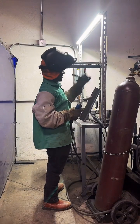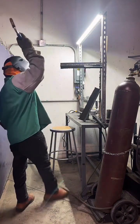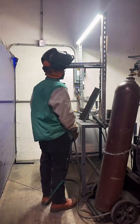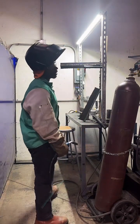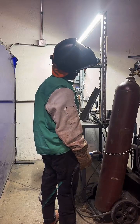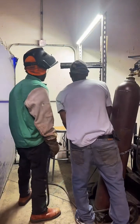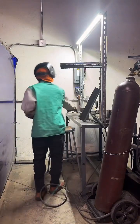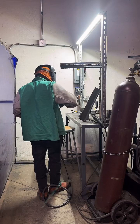Oh, shoot. Let me try something real quick. Let me look at this heat while you're doing something. Hold up. Start where? Start at the bottom, or you continue doing the top? Yeah, nah. Go on and start at the bottom. I just amped up the heat and the wire speed a little bit, and tell me how that sounds. We're gonna see how this runs, and then we'll go from there. If anything else, we'll drop down some instead of going up some more.